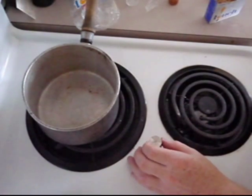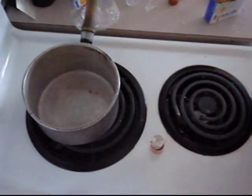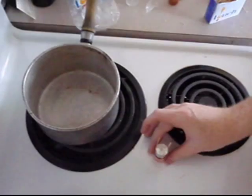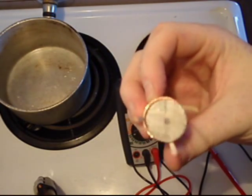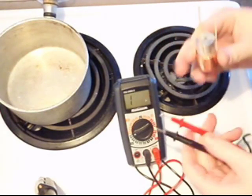Place the magnesium electrode in the copper pipe cap and shim the electrode into place with toothpicks to prevent shorting. Ensure the magnesium hasn't shorted to the copper by checking with a resistance meter.